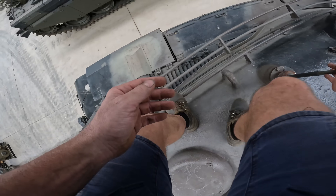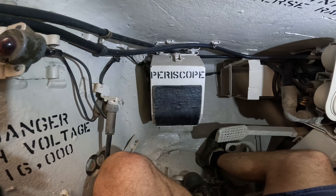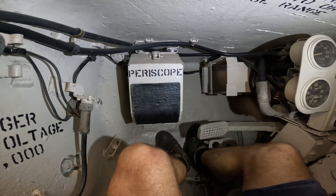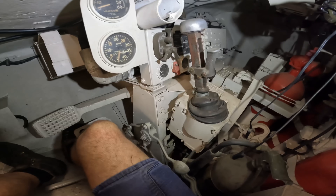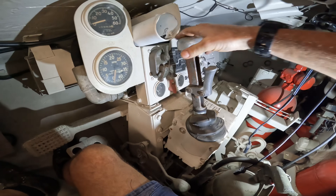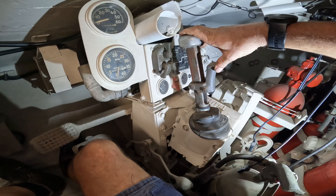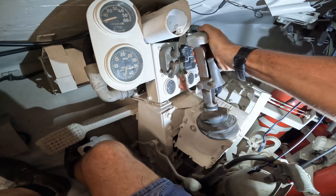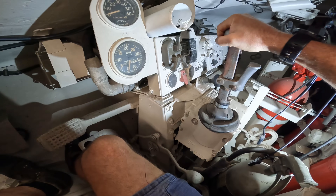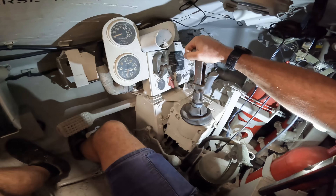While we're up here, there's something pretty cool about the M46. When you get inside the tank you realize there's a lack of conventional controls in front of you — instead of big sticks to pull on, you've got this thing that looks like a proto game controller. It's a combined gear shifter and tiller for steering: moving the lever forwards and backwards selects forward, reverse, high and low range, while moving it left to right actually steers the tank. I'm really looking forward to driving this.